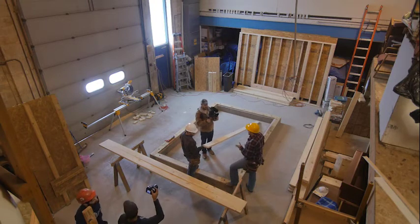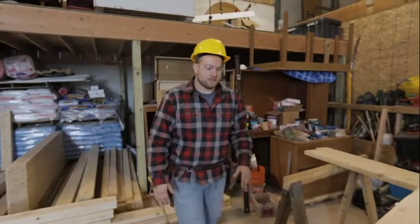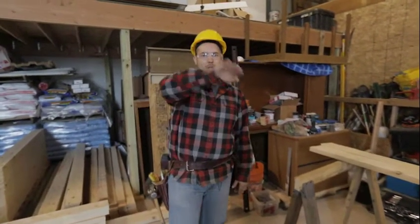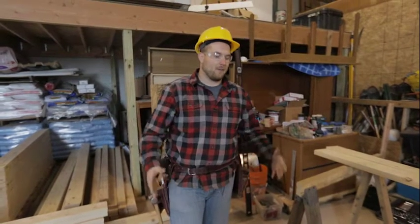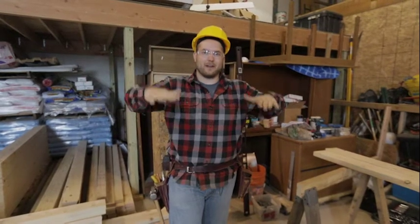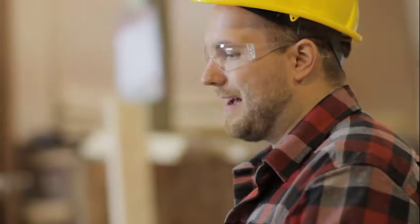When we're selecting our floor joists, we want to check for a crown. A crown is a bow in a board from end to end. If there is a crown in a board, we want to put that crown up so that when we're framing our floor and we have weight coming down over time, hopefully it'll correct that bow if it's a slight one. If it's really bad, we'll throw the board out, but a quarter inch or so is not a problem — we'll just crown it up and start framing our floor.